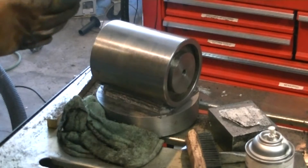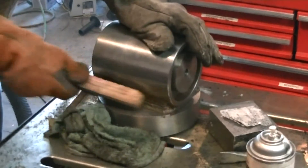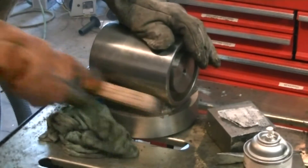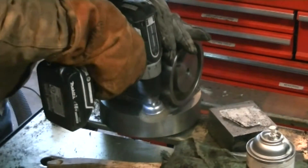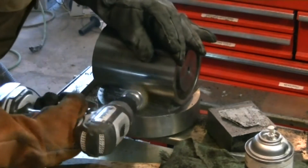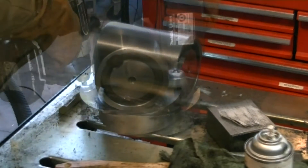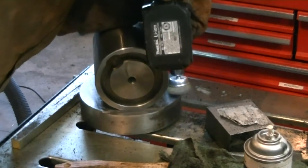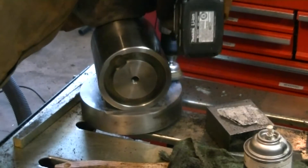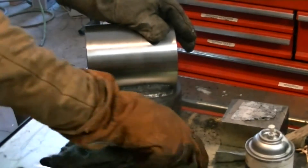There are a few of the electrodes left over. After getting it welded together, there's a lot of wire brushing and cleaning off the welds and getting the metal ready, prepped and ready for paint. I'll actually not paint it initially — I had to do a little sanding and grinding and bondo on the welds themselves.